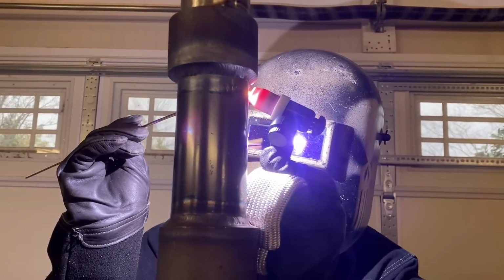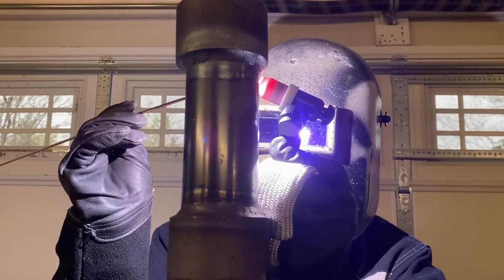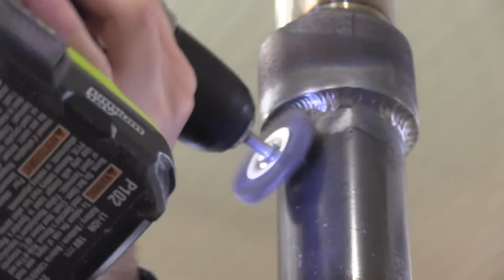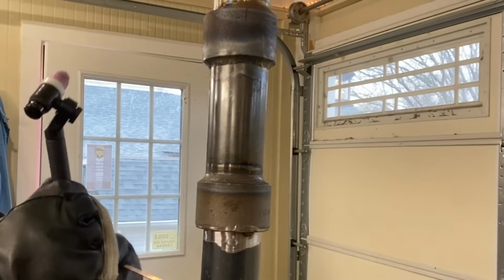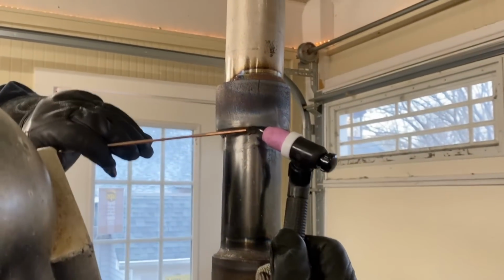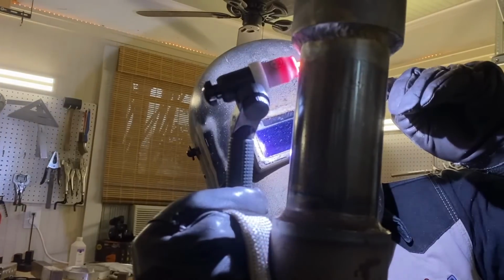Another thing to note is sometimes you kind of want to weld a quarter at a time to prevent excessive distortion, especially on stainless socket welds, because those things will draw a lot more. But if this was in a corner, you're kind of limited to what you can do. By the end of the second pass, things getting kind of toasty, so it's time to let it cool for a few minutes before the final pass. That's usually good advice on a socket weld or any pipe weld for that matter. Things can kind of get out of hand with you if you go stop to finish, root to cap.